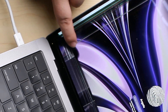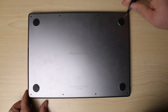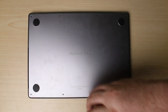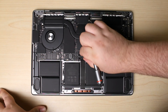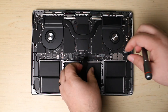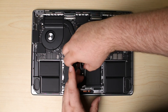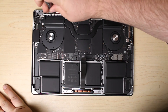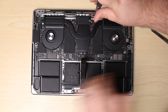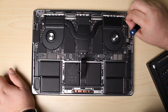This MacBook Pro A2442 has a broken display. We'll power it off and take out the screws on the back so that we can pop off the back panel. Let's isolate the battery by removing the two connectors and the screw. There's a series of screws at the top that we need to remove in order to remove the bar that has these three coax cables attached to it.